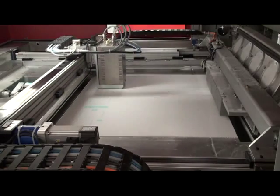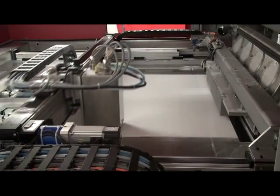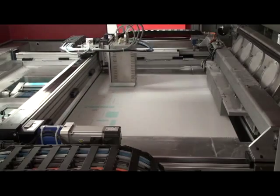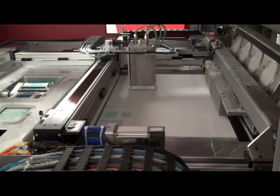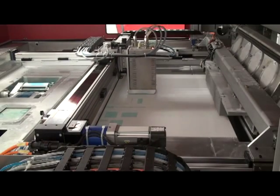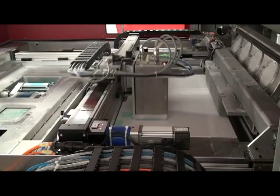The binder is blue as it's sprayed but eventually turns clear after the part is cured. The printhead has 768 individual jets and it takes 35 seconds to complete one layer. That results in a vertical build rate of three quarters of an inch per hour.